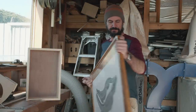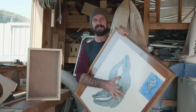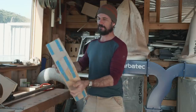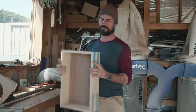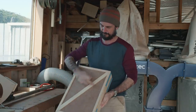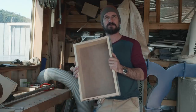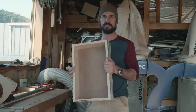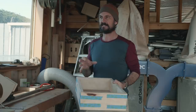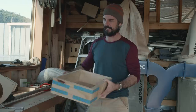So what I've got at the moment — here's the table — and we're going to cut a hole and make a lid here, because underneath I'm going to secure this box. This is just a quick half-hour box that I made, with mitre joins and a ply bottom, reinforced here just to give it a bit of stiffness. This is going to hold our plates and our bowls, because we just couldn't find a good spot to put them. Instead of making a drawer which you would need to fasten, we're just going to have a lid so we can go down through the top of the table.